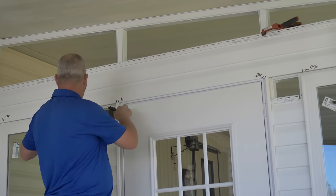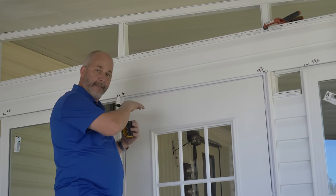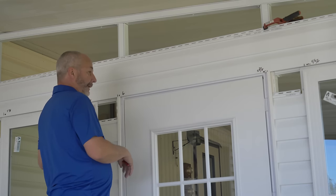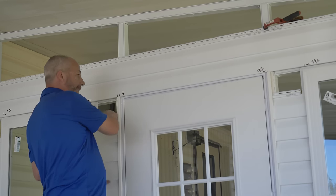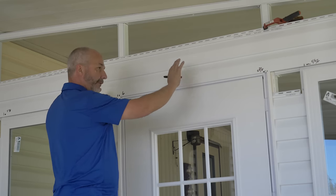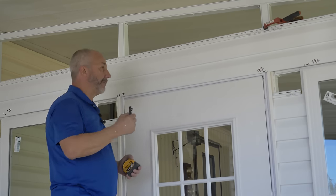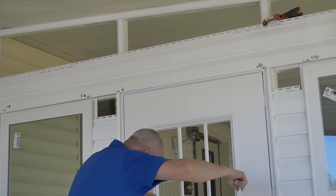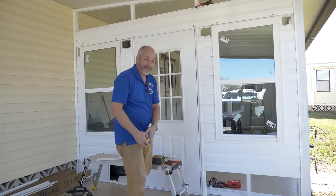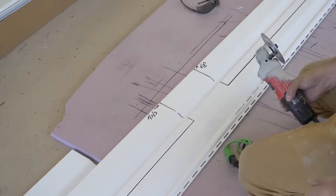The key here is to have this piece locked into all four of these runs of siding and make sure that it finishes off one horizontal piece. If you don't have the accordion effect, you're going to have to have a split above the door, and you're going to have this installed off-center and crooked and weird. You're going to see a line going like that. It'll scream, okay? So now we're going to cut this. We'll put the J-trim back up, and we'll snap this thing in place, and you'll see how nice that looks. We'll cut all of this out.